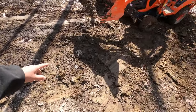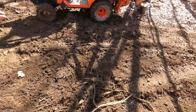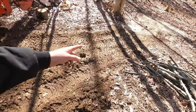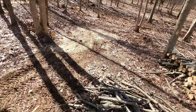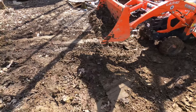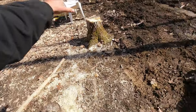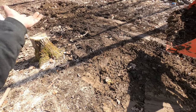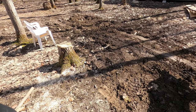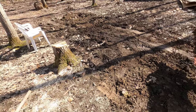We'll inlay tile — underground drainage pipe — and it's going to come all the way down, about 100 feet of pipe, and hopefully that will take this area where the water collects and dry it out. It's really not wet now but it's just kind of a nuisance, and that way when we bring in dirt and regrade everything, everything's good to go.